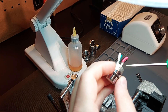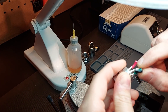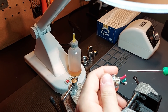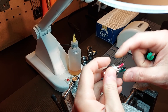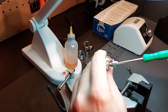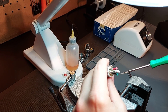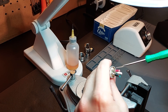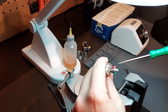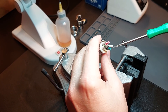We've also got knobs on the bottom. This green lead was wrapped around the black lead — something I see a lot of end users do. They try to fight the colors, meaning they try to articulate the cable to get the proper ground in the position allocated for whatever terminal is ground. In this case on spindles that should be pin number 4. What you would do is lay your cable out and then naturally solder in the format the cable is. On a three-phase cable it's arbitrary which leads you use for power, since they're all supplying power — power, power, power — and then you have your ground lead.